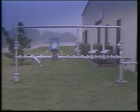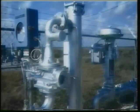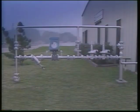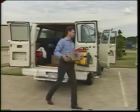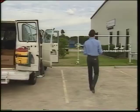The flow should be from left to right when facing the drive end of the meter. In both cases, the rotor axes are parallel with the ground. Meters in either installation should be in an isolation bypass. Of the 2 mounting positions, vertical installation is preferred because gravity helps pass dirt or scale through the meter. Other piping layouts based on established practices may be equally satisfactory, especially if a strainer is used ahead of the meter. The first step in installation is unpacking and checking the meter.